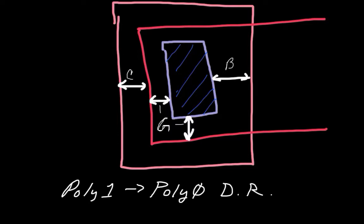And if you don't have enough overlap — if you don't extend far enough past it — let's say you were coincident to this edge, the two edges are coincident: what can happen is when you do your poly one, you're a little bit misaligned to the poly zero. So you get a partial step and you could have a little fiber, a little stringer they call it, of poly one that gets stuck in a corner of that step and ends up floating away. So you could get a stringer if you didn't adhere to that rule. You've got this design rule, this design rule, and this design rule, and this one that you have to adhere to. There's also a minimum design rule for all these structures — they have to be at least a certain width.